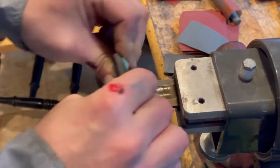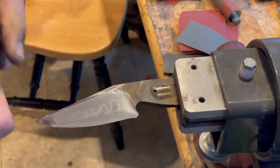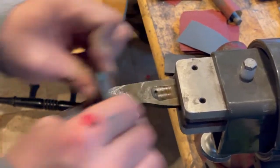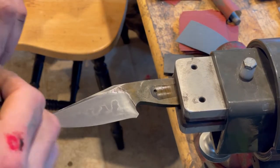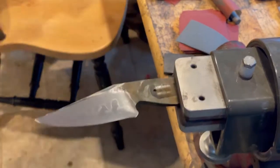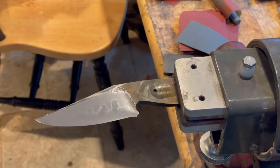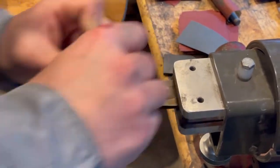And one thing that you're going to learn really quickly when you start getting into hamons is there are a million ways to skin this cat. There is no real right answer on how to do a hamon. It's really just about what your preference is. Like I said before, you don't have to take it all the way to 2,500. Even some hamons I take to 3,000, and I'm going to start taking other hamons up to 5,000. That's not necessary for all blades. It just depends on what your preference is, what your experience level is, and the amount of time that you want to spend on it.